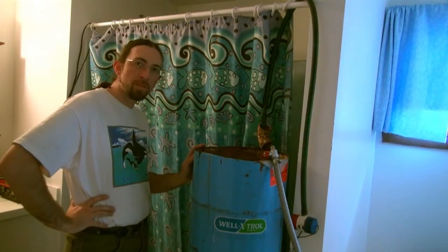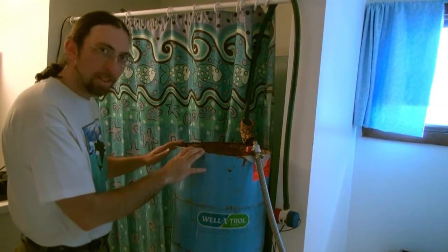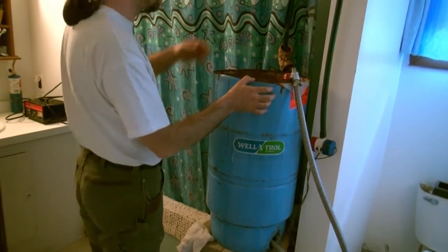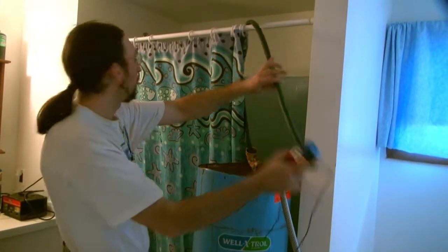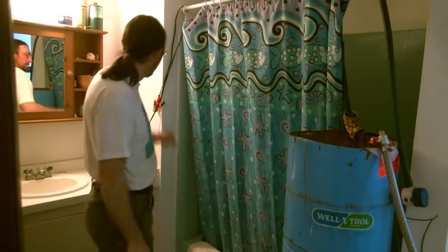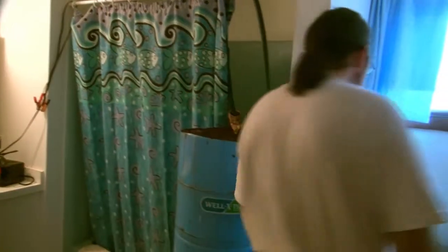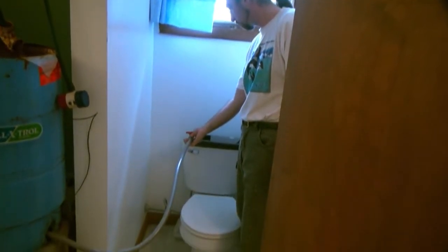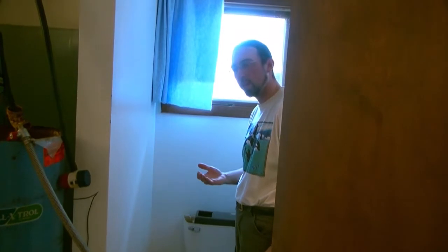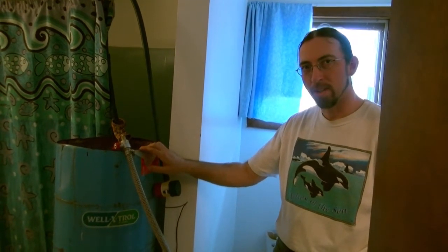This is a single purpose water reuse system. When we replaced the pressure tank for our well pump system, I cut the top off of the old one with an abrasive disc on a skill saw and put it on cinder blocks high enough to get enough pressure. So after bathing or showering, I use this marine pump, 12 volt powered off of a car battery starter, through these clips onto the pump to pump the water into this tank. From here it just gravity feeds into the tank of the toilet, so we never have to use water from the well to flush this toilet. That's particularly good not only because it takes a lot of energy to pump water out of the well, it also means we have five to ten flushes ready and waiting for every time we get the next week-long power outage which happens out here in Barrington.